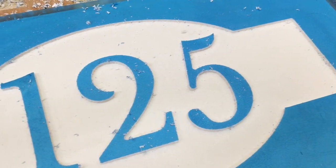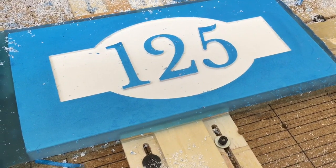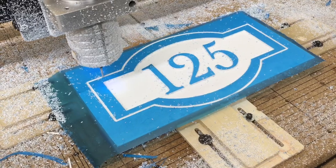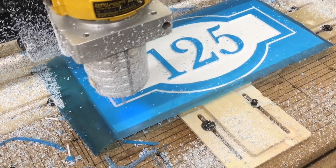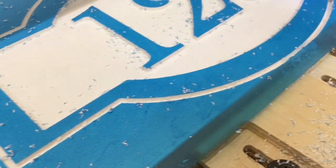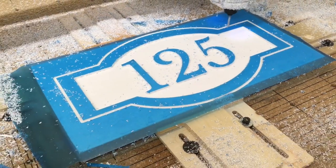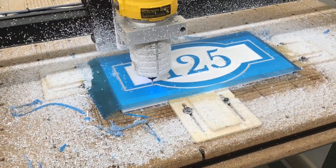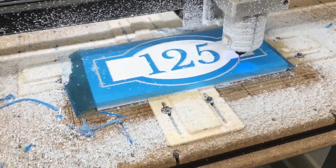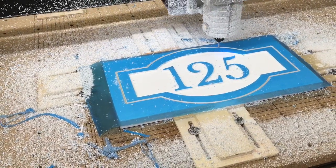The pocket is actually done now and hopefully you can see how clean and nice it looks. Now it's time to do the actual cutout. You may ask: could I have done this all in one carving? And the answer is yes — I didn't really need to set up a second work piece just for the cutout, but this is more of a habit I do just to keep it separate. All total, this project took about 40 minutes to carve. The main reason the actual cutout took about 20 minutes is that although I sped it up to 80 inches per minute, I did not change the depth of pass, so it actually made more passes.